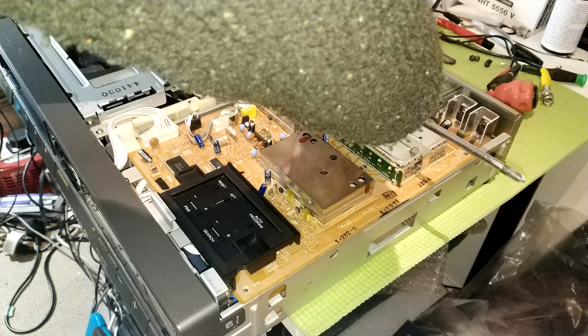Now I do wonder what is wrong with this board. I've done a couple of these — the last one was a C9. They use these Mitsubishi-based processors for tuning control and input select. I changed it on the C9 and I think I actually did a video on it. It worked perfectly — absolutely brilliant — for about two weeks, and then it failed again. In the end I changed the whole board and it was fine.